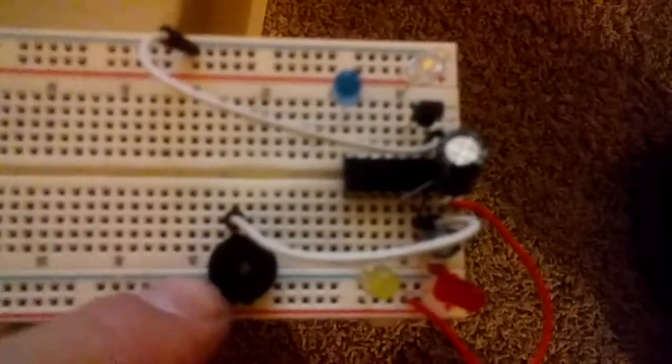That's the little thing making noise there. I just put it there just for giggles. There's one transistor right here between the first LED and the last. That was just to change the polarity. If you notice, the next LED is hooked in the opposite direction than this one, and that way also helped me separate the timing, and then the capacitors help me time the separation.